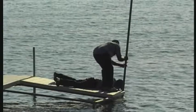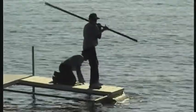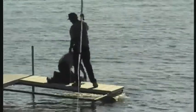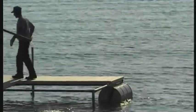When using only one barrel, you must only loosen one vertical pipe at a time, starting with the pipe closest to the side the barrel is located and removing the pipe and deck on that side first. In this situation, when removing the second vertical pipe, we are showing the two-person process because this pipe has a mud plate. Try to keep the body weight of the person that is lying on the deck as far back onto the frame as possible to maximize the flotation of the barrel.